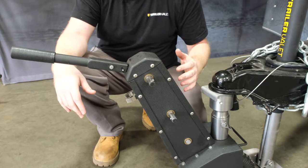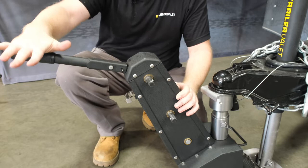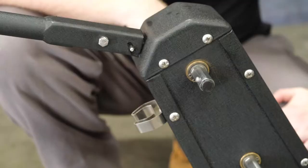A question I'm frequently asked is: our brake handle will not drop anymore, it is stuck. If it is stuck, it's because the bolt is hitting in between your lower gear shaft. All you need to do is rotate the shaft — the bolt will find its way in and now you can drop the handle.